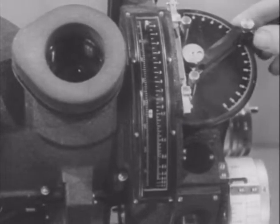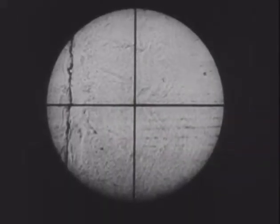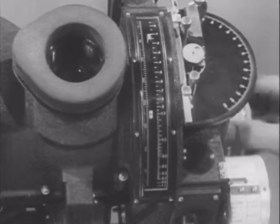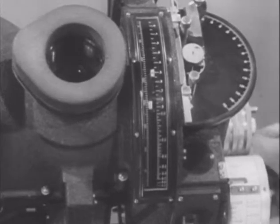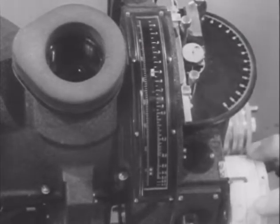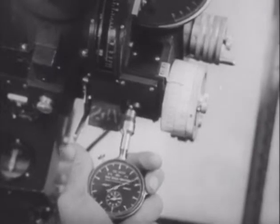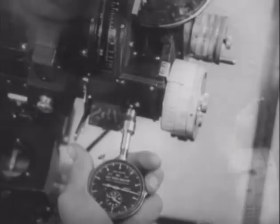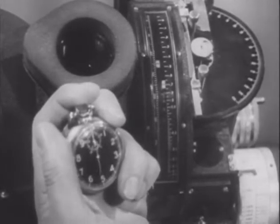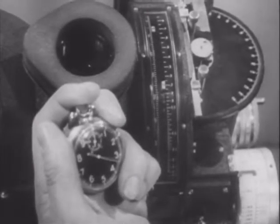Now set in 50 mils of trail. And the optics don't move at all because the roller is smack in the center of the disc — that's okay. Only don't leave it that way or the roller will wear a hole in the center of the disc. Trail arm back to zero and your rate index to point five again. Then move the sighting angle pointer to the bottom of the indicator window. Now what about roller slippage? Set the correct disc speed for any corresponding time of fall by using your tachometer. The trail is at zero, so we start the stopwatch and telescope motor at the same instant with the indices matching. It takes actual time of fall for the telescope to cover the whole range. So if our telescope index reaches zero as our stopwatch reaches actual time of fall, then the roller isn't slipping.